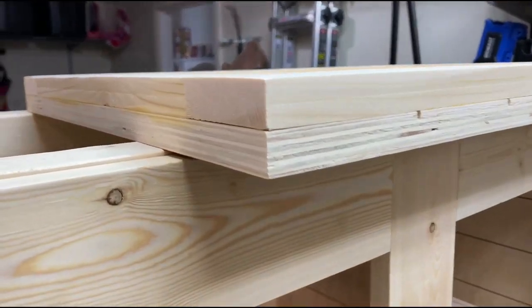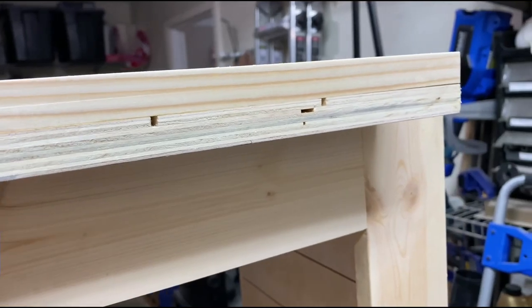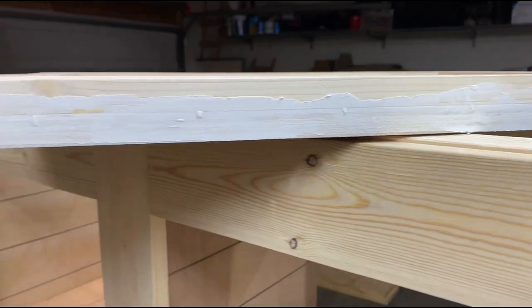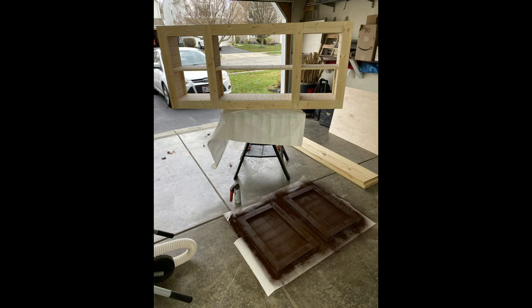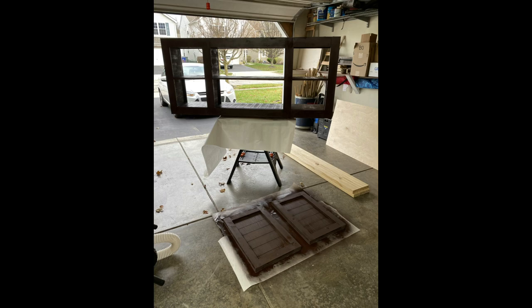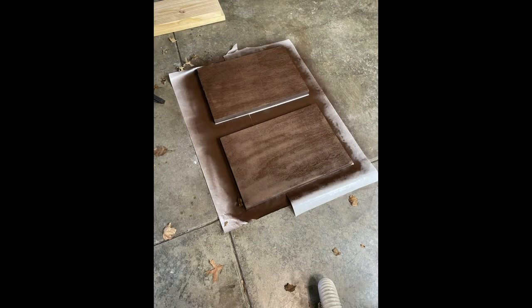This is a shot of the side of the sliding door. You can see the three-quarter inch plywood has some gaps from the shiplap cuts. I just used a putty or wall mud like you'd use on drywall to fill that, then sanded it to make it look a little bit better. Next step was to lay a base coat of espresso paint because I'm going for a washed or weathered look painting over top of this. Everything gets the espresso paint including the back panel, the one-quarter inch plywood, and the sliding barn doors as well — I did the back too just in case anything was showing through.